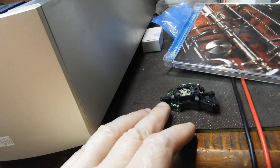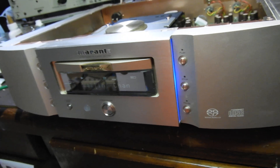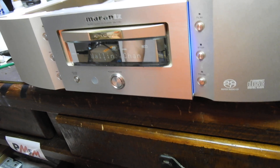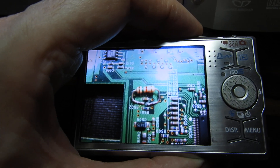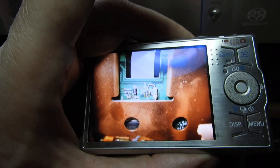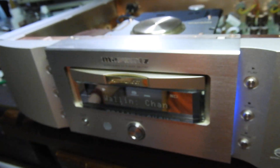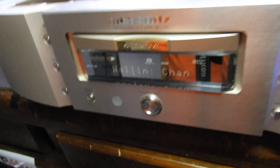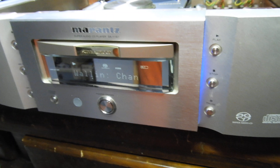I think I'm using the original laser now, and I'll tell you why in a moment. When trying them all, I first tried the one installed and it worked after adjusting and doing some calibration work. When I then tried the others that didn't work, I noticed a large resistor on the board surrounded by surface-mount components, sitting right in the path where the laser travels. I looked up the service manual — it's supposed to be a 100 ohm resistor, but that one measured 1.5K. I have no idea why anybody would put that there, but I replaced it with 100 ohms.